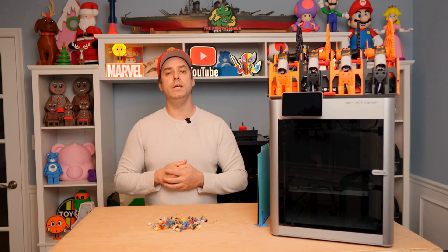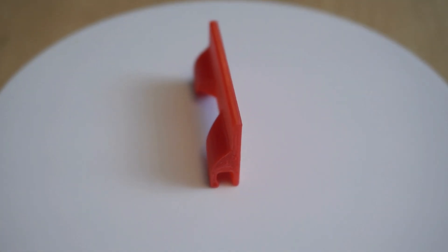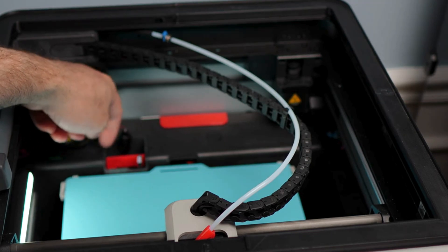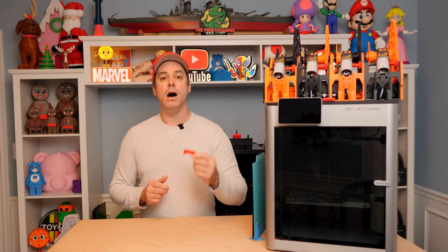Links to all of these will be down below in the description. At some point you're going to experience purge waste making its way back onto the print bed, which can cause a print to stop or interfere with finishing a print. This little clip is a purge chute extender that clips on the very top of the purge chute and helps mitigate the possibility of filament making its way back onto your print bed. A very simple print and a nice insurance policy to keep the inside of your printer free of debris.